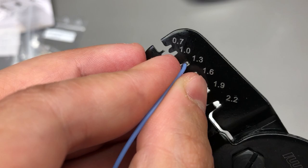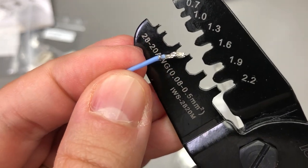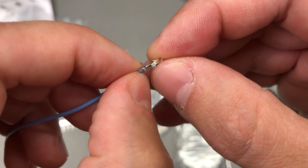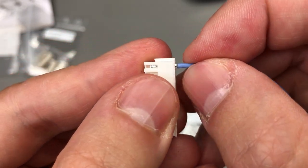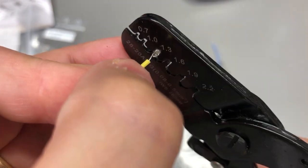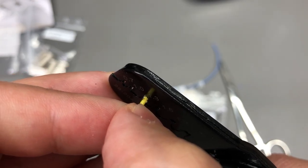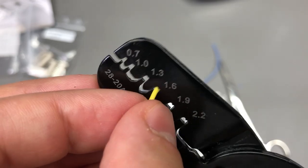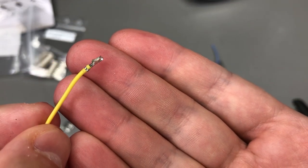You don't want to overdo the insulation crimp or you'll deform the connector and it might not slide into the shell anymore. On my first attempt you can see how I deformed the crimp by applying too much force, but it still inserts fine into the housing and it's a solid crimp — not pretty but functional. A quick check: just pull on the wire and it should be firmly attached with nothing sliding or moving. On my second crimp I used the same 1.3mm die for the electrical part but moved to the next size for the insulation, which resulted in a better fit. Your results will improve as you do more crimps and get a better feel for the tool.